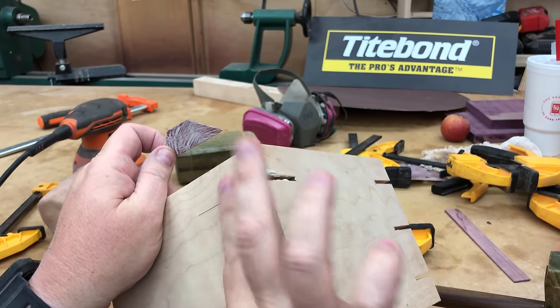With the sanding done it's time to put the finish. We've cleaned off the sawdust and we are going to use Deft semi-gloss clear lacquer to finish this with, and that Pacific Coast maple really pops with that finish. When you're spraying it's important to start your spray outside of the box, spray all the way across, and then don't stop the spray until you get past it on the other side — that gives you nice uniform even coverage. You'll be able to see that obviously here when Maya is spraying: she's starting outside, spraying past it, and repeating that cycle with each row kind of over-spraying the previous row. After three coats of lacquer we usually take 1500 or 2000 grit sandpaper and go over the surface of the lacquer very lightly. This takes off any tiny little bumps or burrs and leaves us with a finish that feels glass smooth.